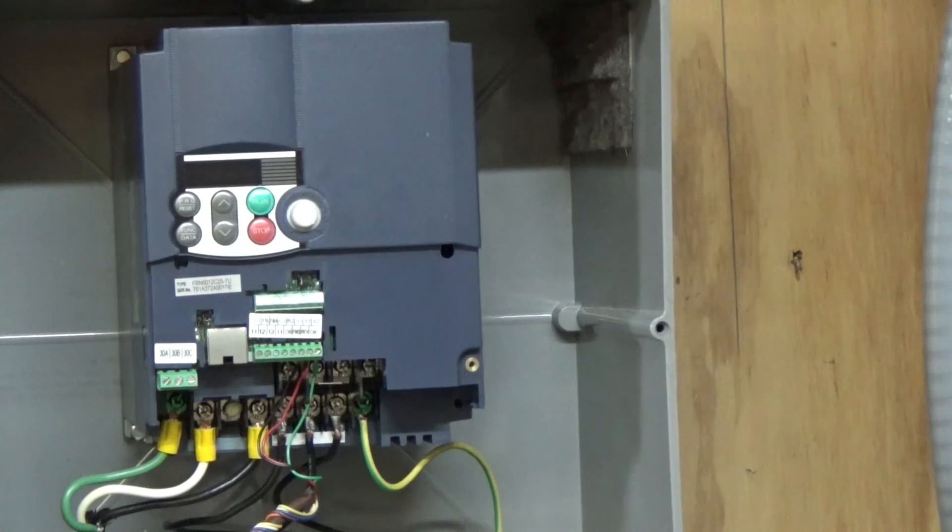I don't think you can electrically damage the machine by inputting any settings — it's going to give you an error if the value is incorrect or if you spin it up and it's got too much load on it. It'll give you an error and protect itself. So it's got a lot of built-in protections and a lot of advantages. Another advantage with a VFD is you get full horsepower. This is a three-horsepower motor, three-horsepower VFD.